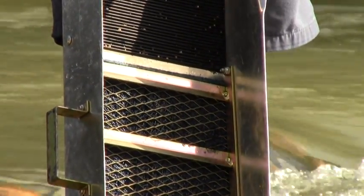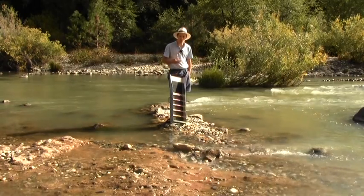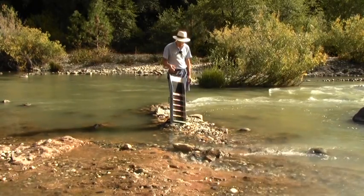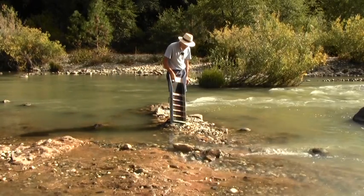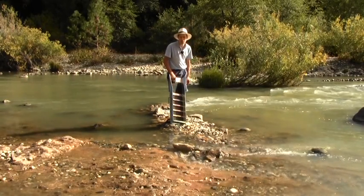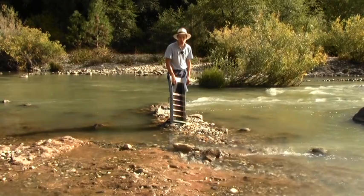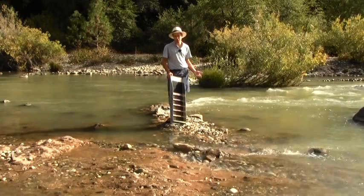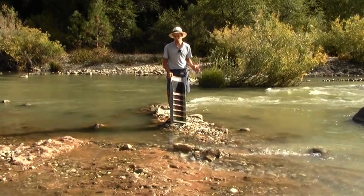That's the basic understanding of the sluice. This up here is the assay mat. What that does is show you a sample of what you're catching right now. So when you have a handful of dirt that you think might have gold in it, this is a series of little U's or V's depending on the type of sluice that you have, and it's going to trap the gold inside each one of these. That's not going to trap all the gold, but it's going to trap a percentage of it — maybe 10 to 50 percent, depending on the type and shape of gold you have.